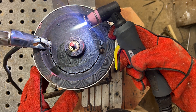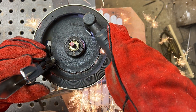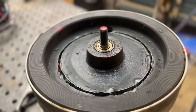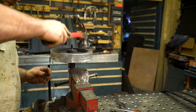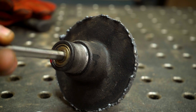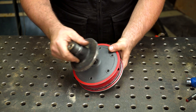Let's hope the plasma torch can cut this cast iron wheel without problems. The plan for today is to take a very small pulley that I have to connect to the dynamo itself. The smaller the pulley is, the faster the dynamo will spin and the more electric current it will produce. I just have to figure out how to connect the two things together properly.